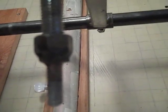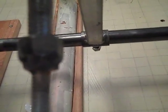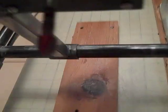Basically what I do is I've got my banjo neck here — I use the feeler gauge and move it back and forth, and it cuts on a piece of wood stock the exact same thing with the router bit right here. I've got a few extra tips — I just welded a nut onto this threaded rod, and I've got a couple of different sizes depending on which router bit I want to use. That's how I got away with that.